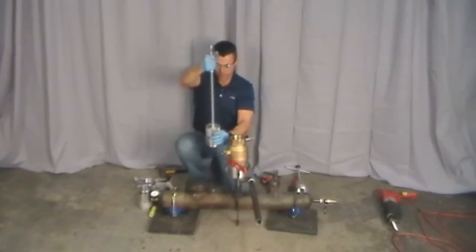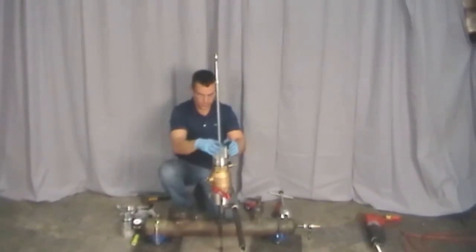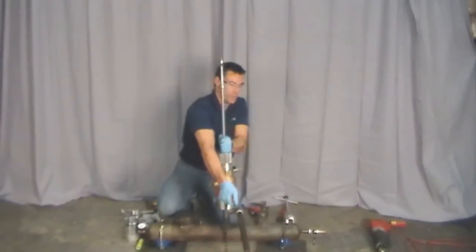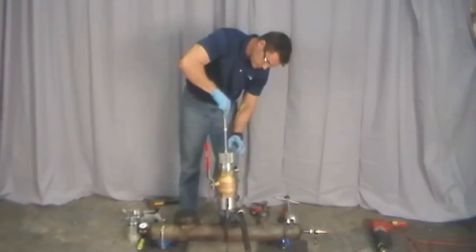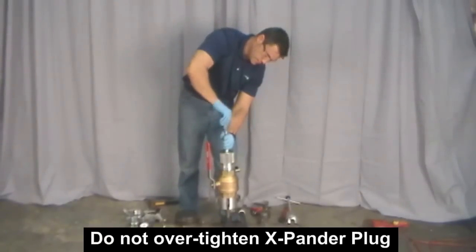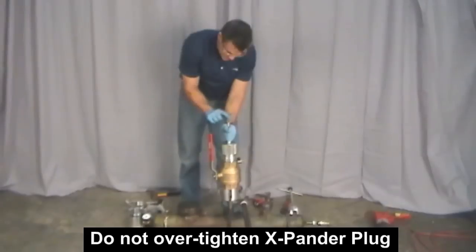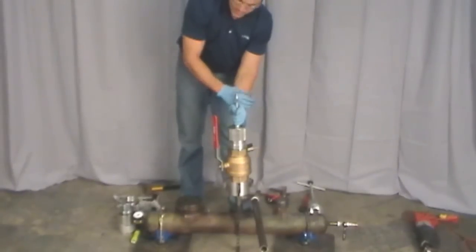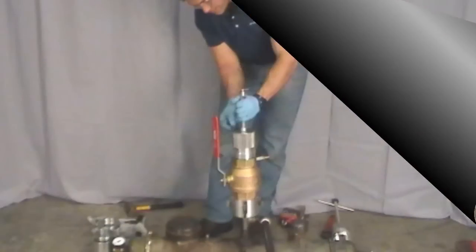Next, fully retract the shaft and fasten the assembly onto the ball valve. Make sure the chrome plated valve is in the closed position. Hold the shaft in the fully retracted position with one hand and slowly open the ball valve, taking care to prevent the shaft from moving upwards unexpectedly. Push the shaft down to the collar. Simultaneously, hold the shaft into position and turn the small T-handle clockwise with two fingers to expand the plug. Tighten until noticeable resistance is felt. Open the chrome plated valve and bleed off the excess gas that remains in the service. Once you no longer hear the sound of blowing gas, the service has been successfully stopped.